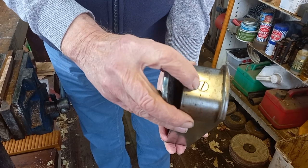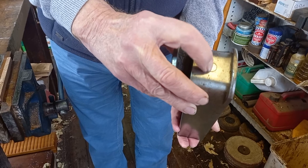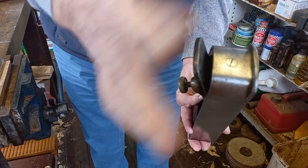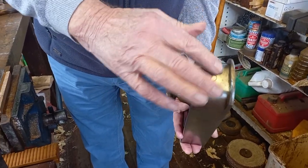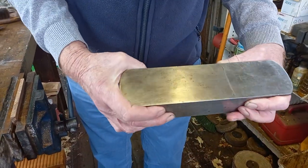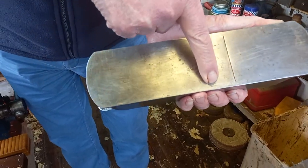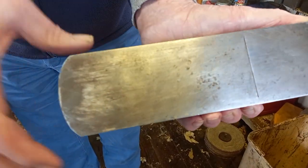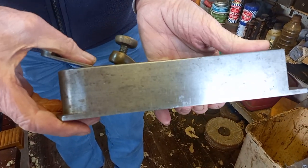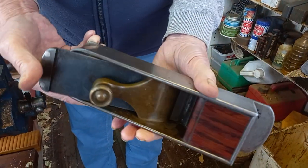Another point I've made in the past: these were not for hitting. I think the cheese head screw is for hitting, but the earlier ones sometimes had nothing in, or a countersunk screw — so obviously not for hitting; it was to hold the infilling. I can't see the dovetails — that's the only trace of a dovetail you can see. It's got a slope for a mouth instead of a tongue groove joint. Beautiful plane.